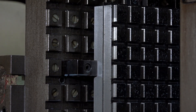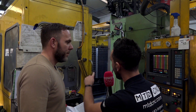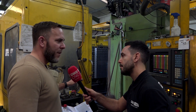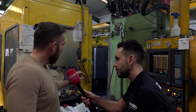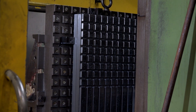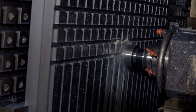When you're holding that kind of weight in a vertical position, there's a lot of forces that want to pull it down. So is this really illustrating the clamping force of the Micro Lock? Can you describe the way in which you've situated the clamps and stops? Well, we've got the fixed jaws on the bottom — about three fixed jaws — and that's locating the workpiece. Then you've got three vice jaws on the top and one on the side, and that's holding it and pulling it down onto the face and keeping it accurate. So that is holding all of that weight.